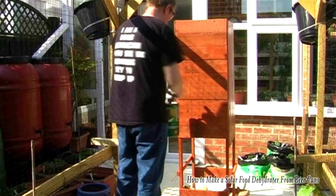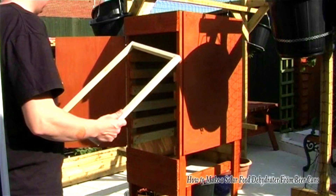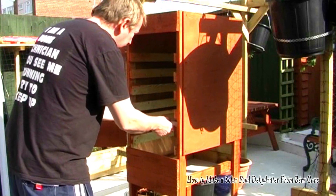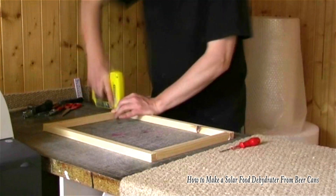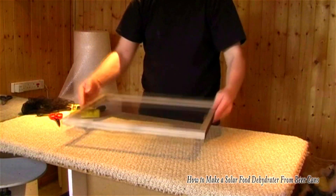All that's left to do now is to paint the actual structure to make it a little bit weatherproof, and of course we need to build some shelves. So all I did for this was take some thin pieces of wood, shape them into a rectangular frame, make sure they fit, and once I was happy with the way they fitted into the box all I needed to do was add some mesh — for that I used fly screen, which is the same sort of stuff you get for windows. I'm just using glue and staples to make the basic structure, then stapling the fly screen into position, stretching it over the frame. The end result is a rack with mesh so you can place the fruit or whatever you want to dry on the top, but the air will still be able to travel through.